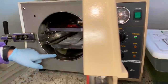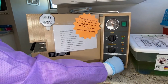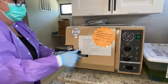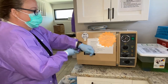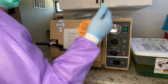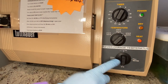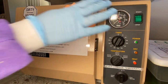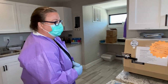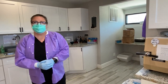Turn the lever to 'fill water' and watch the water rise. As soon as it touches the line, turn it down to STE — which is sterilize. Shut the door firmly enough so it doesn't pop open, kind of like a bank vault, and set the timer to 40 minutes. Once the timer dings, come back and set it to dry for 20 minutes. When it reaches zero, open the door a little to let it cool, then open it fully, take everything out, and put it away. Try not to leave instruments in there so nothing rusts or melts.